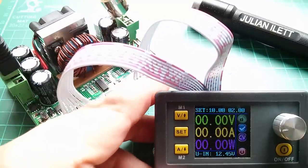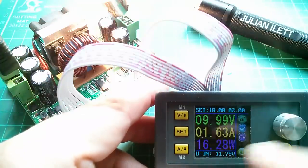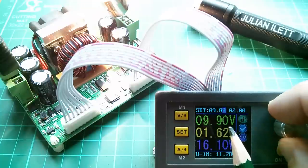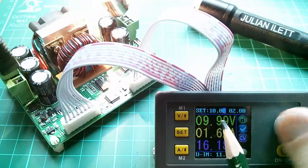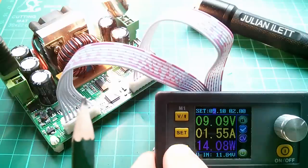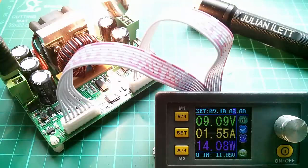I've been playing with this for some time now and I'm starting to like it even more. I was a bit concerned that it didn't seem like you could control the voltage and current limits live on the main monitoring screen. But you actually can. If I press V, I get a highlighted box in the voltage field and I can adjust the voltage in hundredths of a volt. Press it and I can adjust in tenths of a volt, press again for whole volts. And if you press the A button, you get current control — hundredths of an amp, tenths of an amp, or whole amps. That's the current limit set down to one amp.